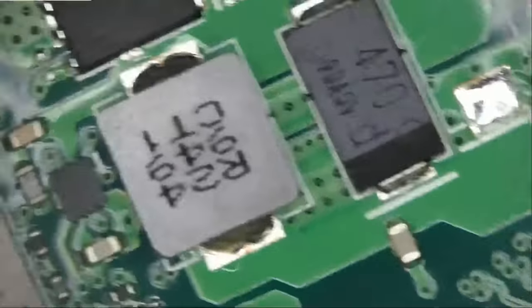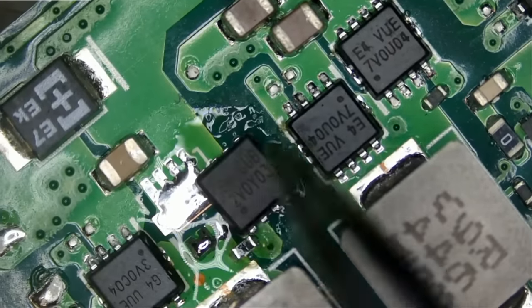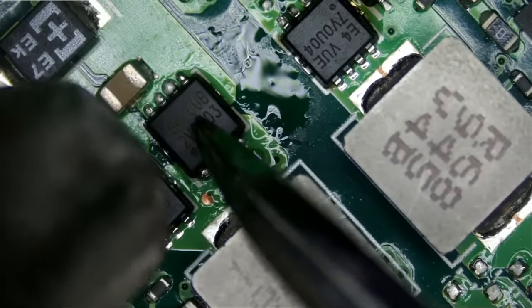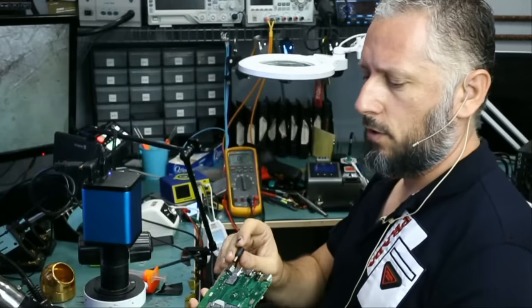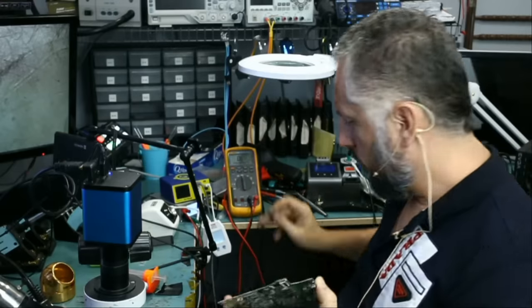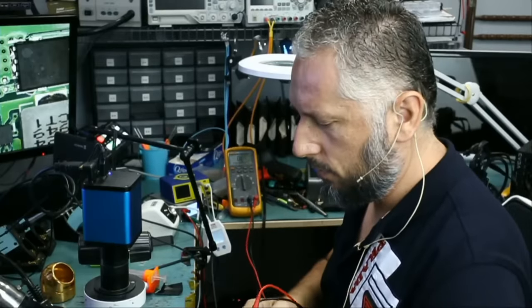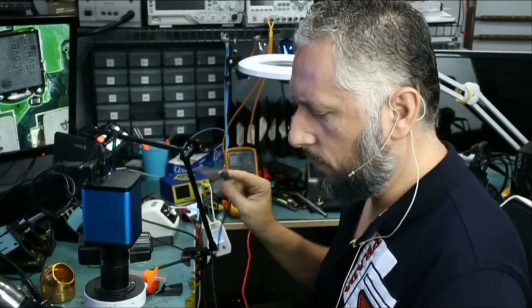We have one more right here. Our gate is on the bottom. The source — three pins connecting with each other — it's okay if they bridge. Let me grab the charger so we can test. I'm going to plug the charging cable just for a few seconds then remove it. I just want to see if anything shorted out. Probably not because we did not turn the laptop on, but it's something I want to do before I give it to Big Boss.